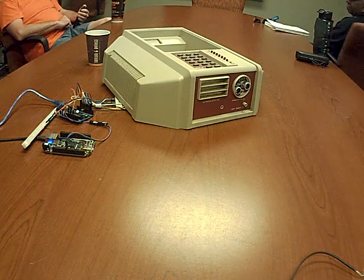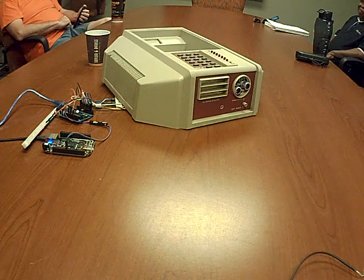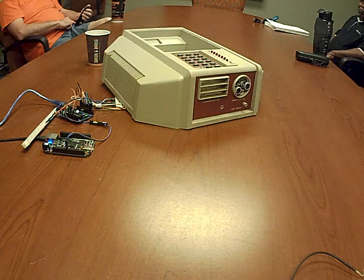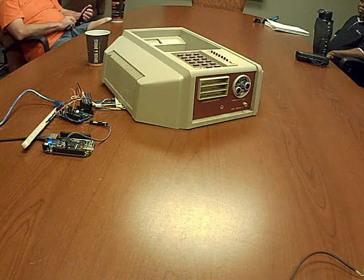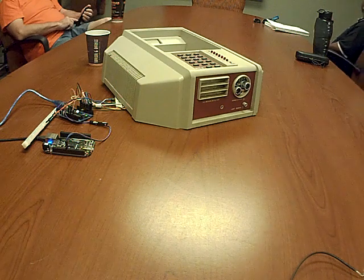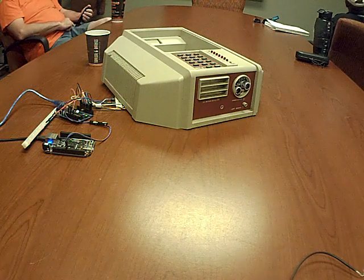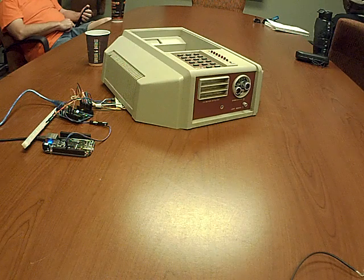This is on the BeagleBone. They've got a built-in web server running. Yep, this is coming right off of the BeagleBone. So when you program it, I'm not real sure where it actually ends up sticking all this in the directory, but it's all in a directory somewhere, so you can SSH into it and find all your Python stuff. I've just been trying that out. And you can just type Python and stick your commands in there one at a time.